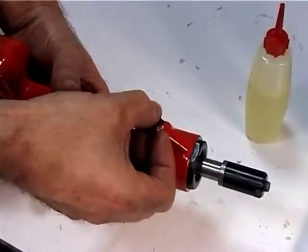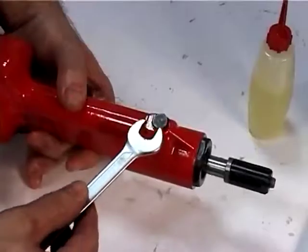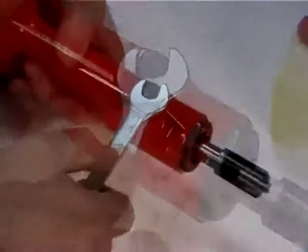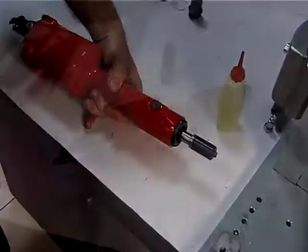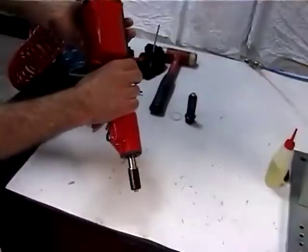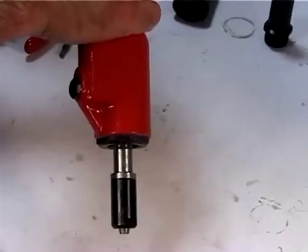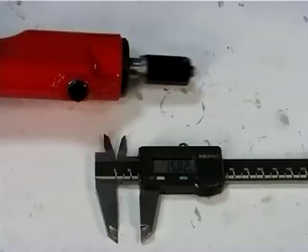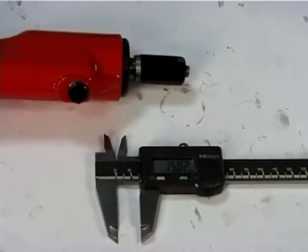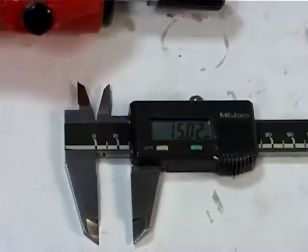Replace the washer, figure 4, then remount the drain cap, figure 3, and tighten it with a torque of 5 Nm minimum to 8 Nm maximum. Feed the riveting tool with pressure of 6 to 7 bars. Perform a few cycles, checking that the stroke is 15 mm. If not, cut off the air feed and repeat the topping up procedures.